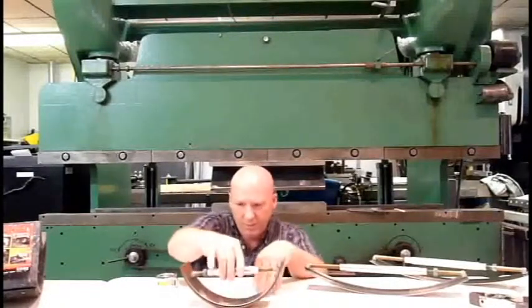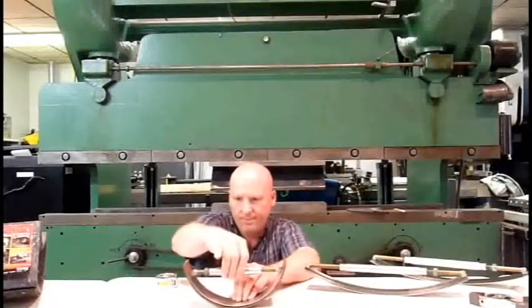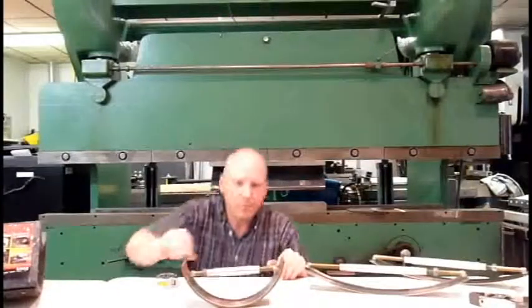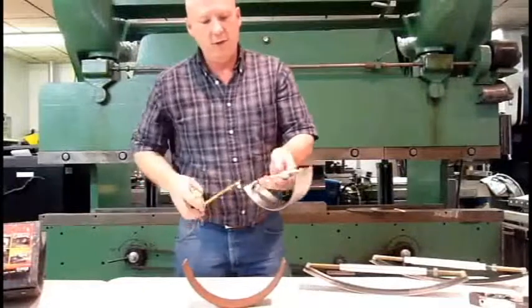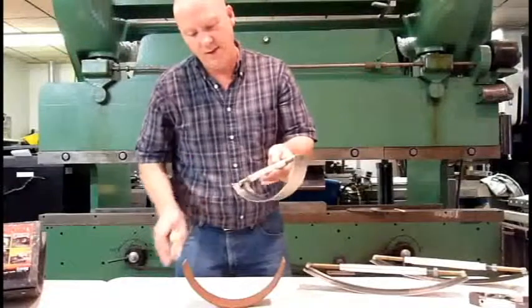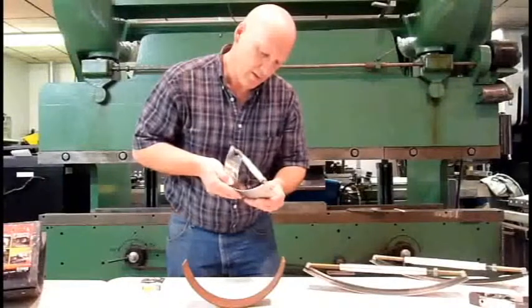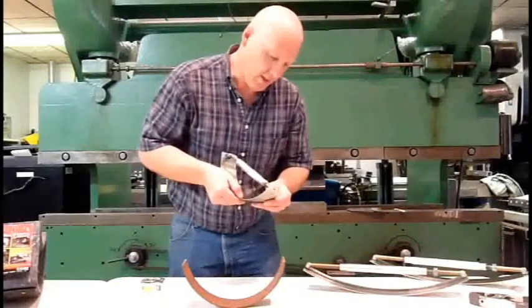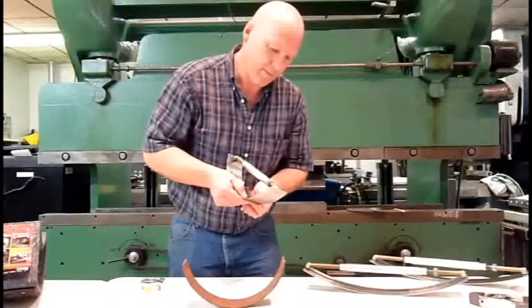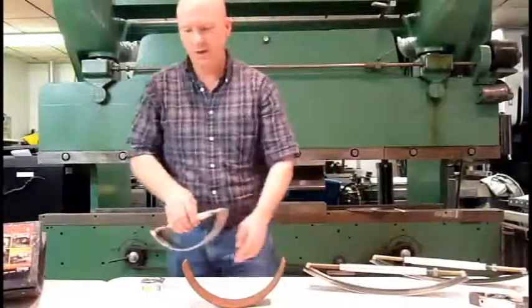This one here is used mainly for radiuses from four inch to a 17 inch radius. We'll get that down in there just nice and pretty, and we'll measure that. Chord length of nine and seven sixteenths. We look on our length here, and that comes out at about a five and an eighth inch radius is what this product here measures out to.